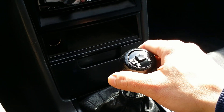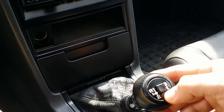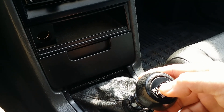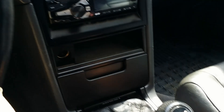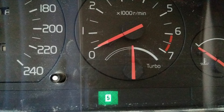When the car is running in 4th gear — and only when it is in 4th gear — we can press this button and put the car in overdrive. It is then in a kind of 5th gear, and we can tell that the overdrive is engaged when this lamp is lit on the dash.